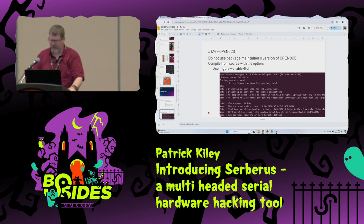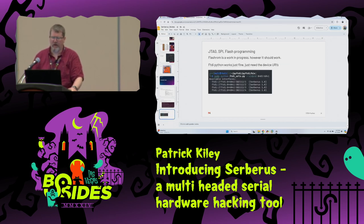And here's a little example showing that it actually worked. JTAG SPI for doing flash programming, if you want to dump flash ROM off of something or actually use it to program flash. Flash ROM itself is a little buggy, a lot for the same reason that it's using a fairly recent FTDI chip, but FTDI Python you can use to dump flash, and that works really well. You just need the device URIs. If you run lsusb, it'll give you the VID PID of 403 and 6041, which you need to specify using the Python tool, and it'll show up, and this is one of the four URIs that'll show up on your Linux machine.